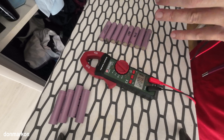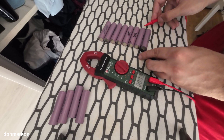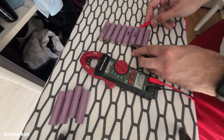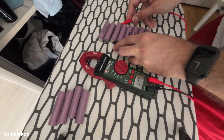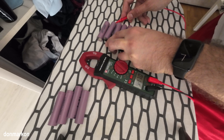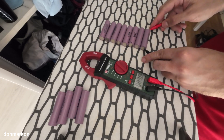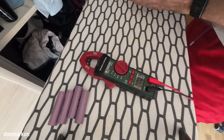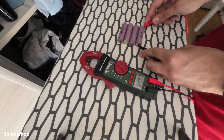I have these cells here that still haven't passed my testing procedure 100%. Cell one is at 4.133V - that's risky, it will probably drop even more. Then we have 4.161V, 4.172V, 4.168V, 4.148V, 4.147V, and 4.174V. This first one is already on the low side - it will probably go below 4.1V, which I don't like. It's not a good cell. I'll try to cycle it a few more times and see how it behaves.